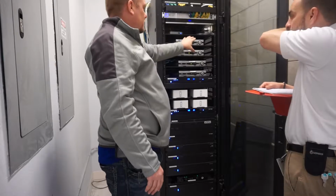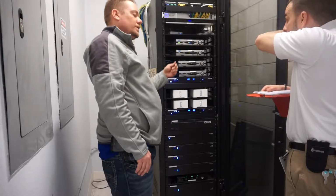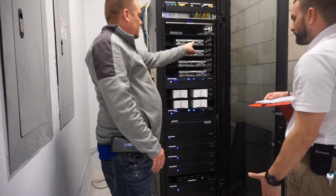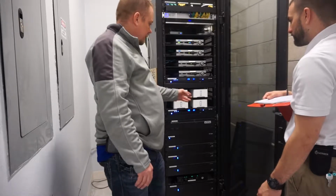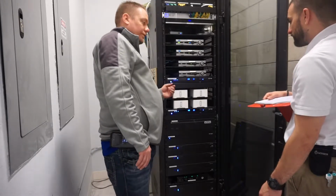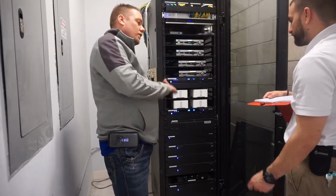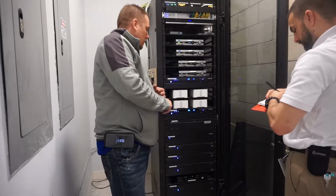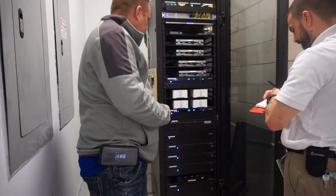These are all your cable boxes, everything's labeled. Just like we discussed yesterday, if you lose control of the cable box, check the IR hood, make sure that you're good. I'll leave you with a pile of those hoods just in case. These are your music players. So they're all labeled. This is the state you should see them in, the white light. If you don't have music and you see a green flashing light, that typically means it's muted. If you don't see any light at all, it's going to be power, that kind of thing.